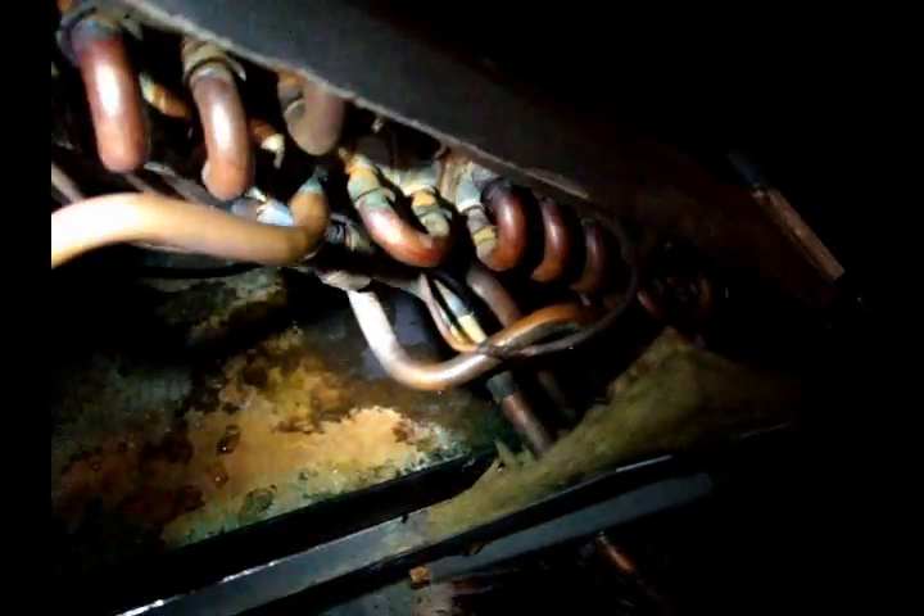For anybody wondering - yes, there was dry nitrogen pumped through the system while I was doing this, just very, very little, so it doesn't blow the braze out of that tiny little pinhole. My camera's having a hard time focusing, but I fixed it. Didn't even melt the insulation. So we'll go ahead and pressure test this bad boy.